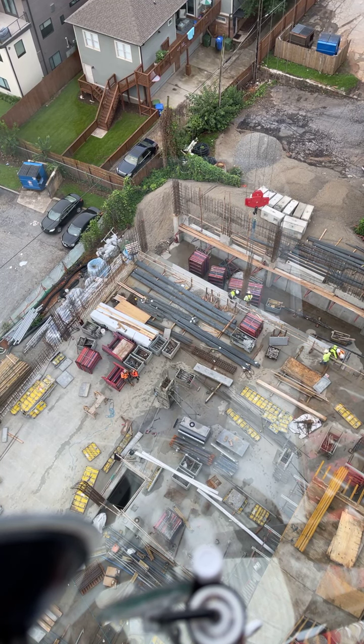I never just go straight down on it, because if the rebar gets caught, they have to make sure the rebar that's on the floor stays inside the column. Touching up. So they've got the rebar crossed. That's why they're having me touch up, because the rebar was trying to go outside of the column. All that rebar's got to stay inside the column.